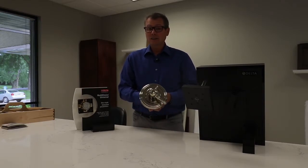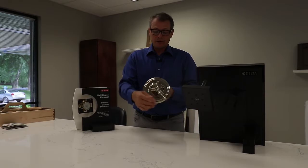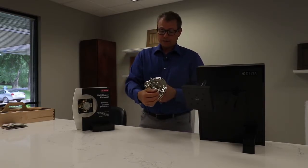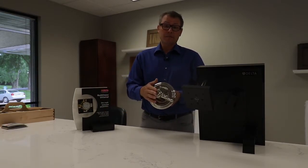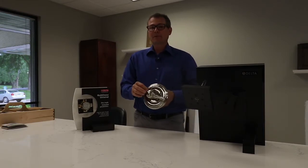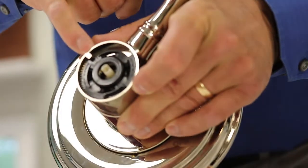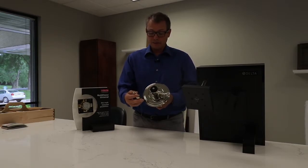What's really nice about this is if you have a handheld or you want to decrease the volume of the shower while you're in there, you can turn it down and if it's at a trickle, it's still going to be the same temperature. Great for tubs, great for kids — when they go in to turn it on, it's always going to come back the same temperature. You're going to fill up that tub of water at the same temperature, so you're not worried about it being too hot or too cold. You can actually set a temperature limit where inside the cap there is a ring that you can turn left and right to set a temperature limit so it won't go over a certain temperature.